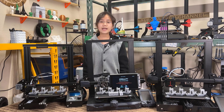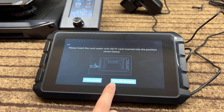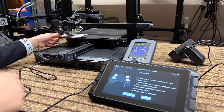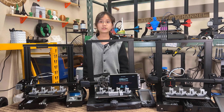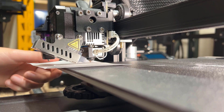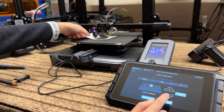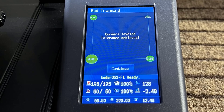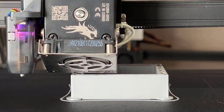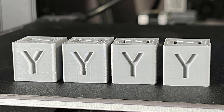Two, the setup and calibration. Setting up the Sonic Pad with your existing 3D printers is easy — it just takes a few clicks on the screen, exporting the printer firmware, and uploading it to the printer. The process should take less than 10 minutes, but you may need another 10 minutes to re-level your bed and set the Z offset. One glitch I found is that when it asks you to level the four corners of the bed, the nozzle is 5mm above the print bed, so there is no way to level the corners before the Z offset is set properly. However, the Z offset is the following step, so unless your printer was already in use and the four corners were already leveled, this step could be quite frustrating. Calibrating input shaping takes less than 10 minutes, but pressure advance calibration takes a while. You can start with around 0.25 and print a calibration cube to see if the corners are overshot or undershot to adjust the value.